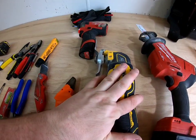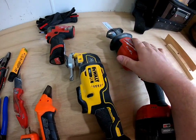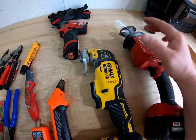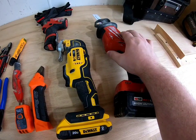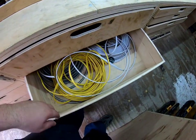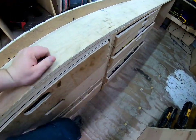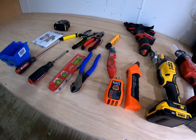For cutting out the drywall, use a drywall knife or an oscillating tool. Depending on the outlet, it might be nailed to a stud, in which case you'll need a hacksaw to cut off those nails from the box. Also, you're going to need a little bit of Romex to feed the two outlets — whether it's 12 gauge or 14 gauge, have both on hand, though you may already know which one ahead of time.